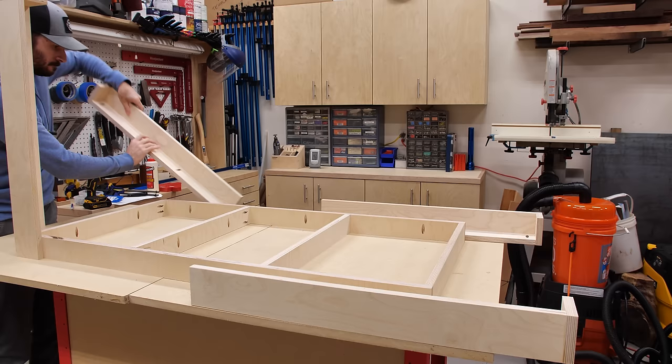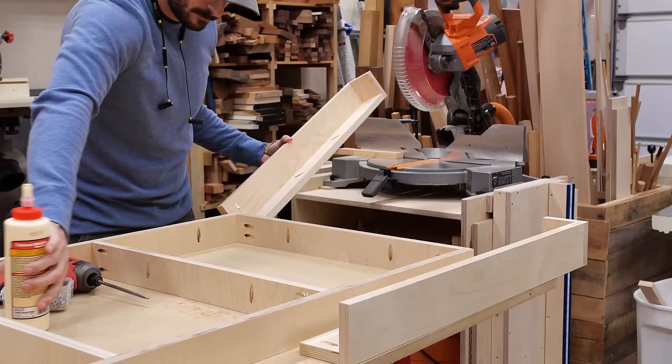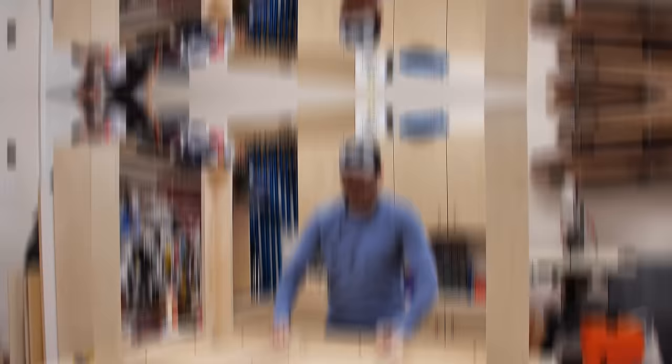With all my base parts ready I brought over the top frame first and laid it upside down to reference the flat surface of the workbench. Each leg gets joined to the frame with glue and two screws per side. I didn't need to clamp anything in place since the screws pull the legs in tight to the corner. Make sure that both the leg and the frame are flush to the table — any dust or debris under either of those would raise it up and translate through to an uneven surface mounting to the top.